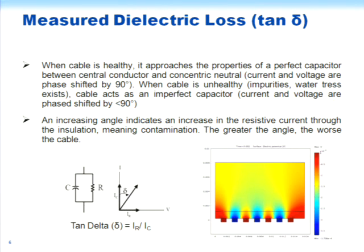Thanks to Steve Boggs' continual suggestion, we're looking not only at permittivity, which we're focusing on initially, but also the conductivity in these insulators, because they may show more of a change than the permittivity. And I believe this plot shows the electric field intensity within a dielectric when you apply alternate voltages to these electrode fingers outside. This approach may be useful.